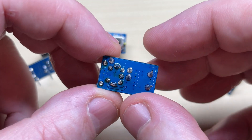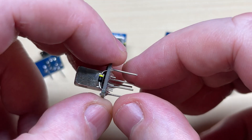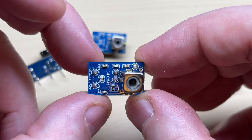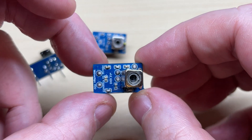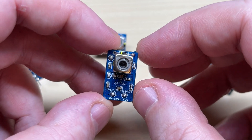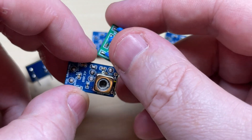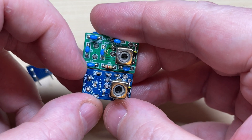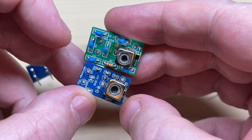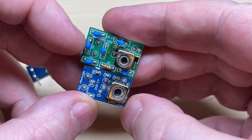It still uses the same coil and the same varicap diode, but all the parts are now surface mount — a double-sided board. This seems to work well and I've sold a few of these with very positive reviews. As you can see it's slightly smaller but still the same pin configuration, so it's a straight drop-in onto your radio.